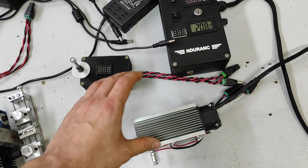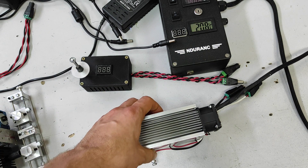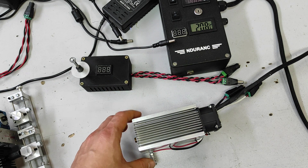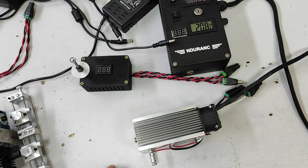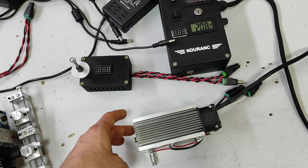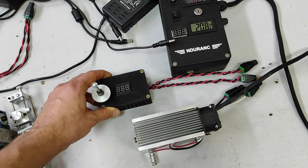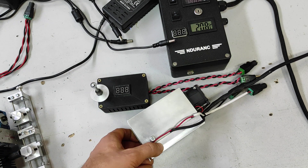Once you start the laser, in idle mode the temperature will drop to maybe 10 Celsius, and that can create some moisture on your laser — water can start to spill out from your laser module. So what we did is offer a DC-DC converter that helps you control your TEC coolers, your Peltier.